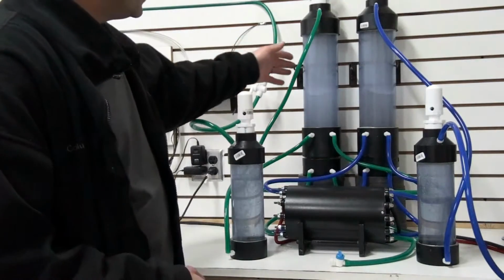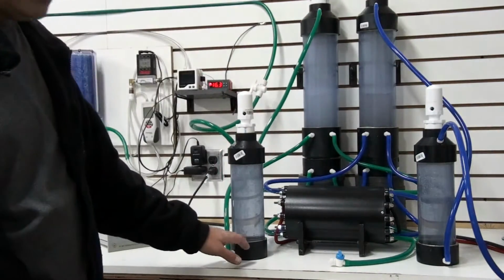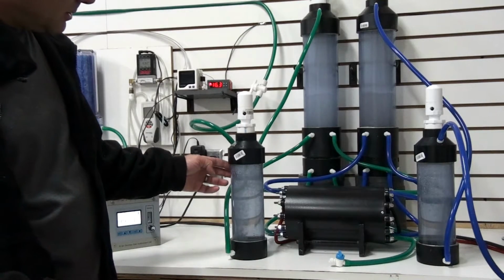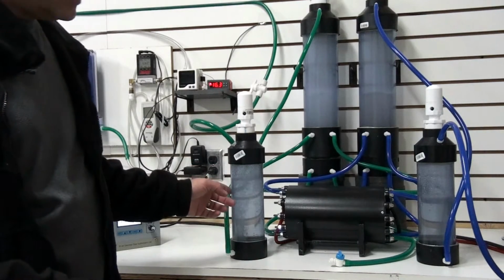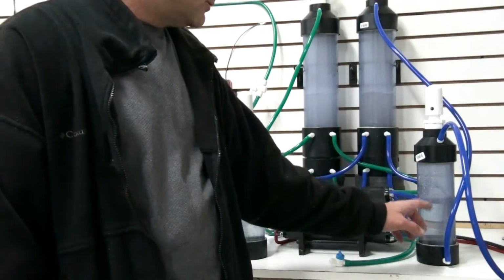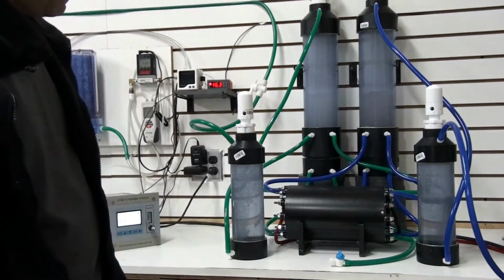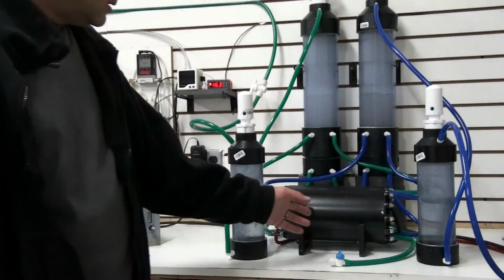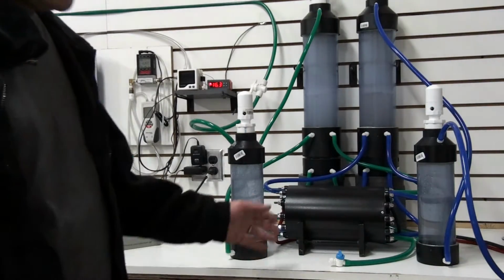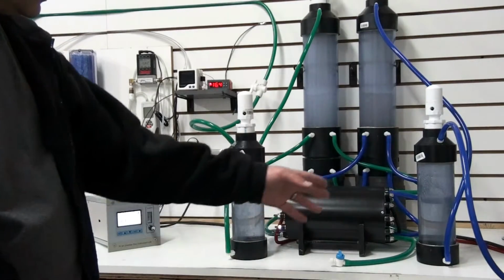And same on the hydrogen side. The gas comes out of the tank and bubbles through this bubbler. You can see right now there's hydrogen gas flowing through this bubbler, and this here is the oxygen gas flowing through this bubbler. And you can see they're at a 2-to-1 ratio. Now water is split into hydrogen and oxygen, 2 parts hydrogen, 1 part oxygen. That's why you have a 2-to-1 split.